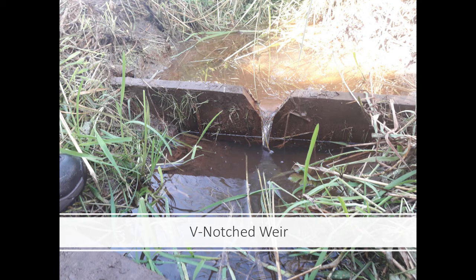You can have a floating ramp off a V-notch weir — a flap of conveyor belt material that you just push away when you want to measure and put back down. My biggest point is around fish passage: if you put water control structures in, you need to make sure you include fish passage if that structure is your main water control, because fish won't come up the spillway unless water is flowing through it.